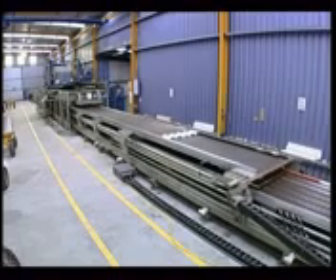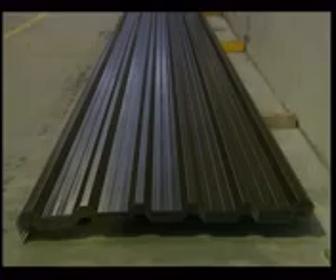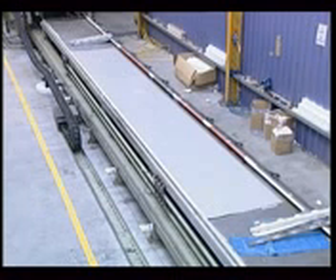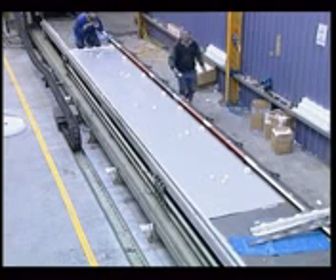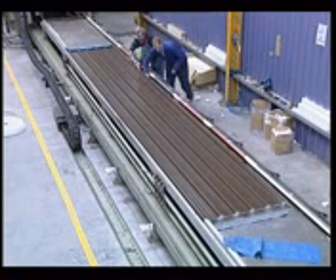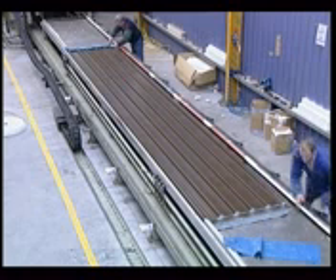With the PXE 2 plus 2, the sheets of metal required to form the panels are placed on the two platens outside the chamber. Loading can take place by hand or automatically. Spacers are inserted between the two sheets of metal, usually by hand, to keep the top one raised. There are several methods of sealing the sheets, including adhesive tape or sealant.